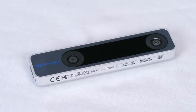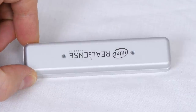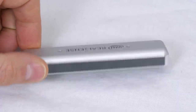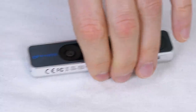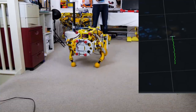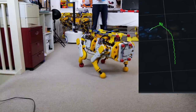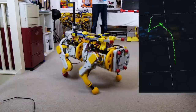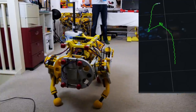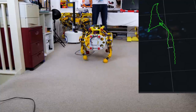In the last video, I tested out an Intel Realsense T265 tracking camera, which will track its location in space in 3 axes of translation and 3 axes of rotation. I attached the camera to my robot dog, and you can find the full build series for that robot in my channel. Clearly it doesn't have wheels to measure, and although it does have feet with a predictable stride, it's very wobbly and the legs are quite elastic, so it wouldn't give us very reliable odometry data.